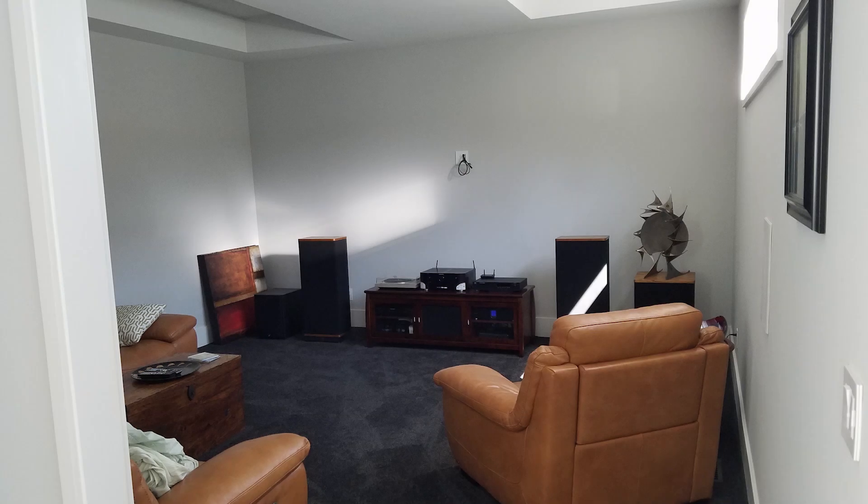Here's our first photo that we want to look at. Got a little setup here, little two-channel setup, subwoofers in the corners again — yikes. No treatment at all in the room, couch to the left channel, chair to the right channel, looks like the listening position is somewhere between those two. Speakers are way too close to the wall, and we're going to have a lot of reverberation time issues with no treatment in this room.